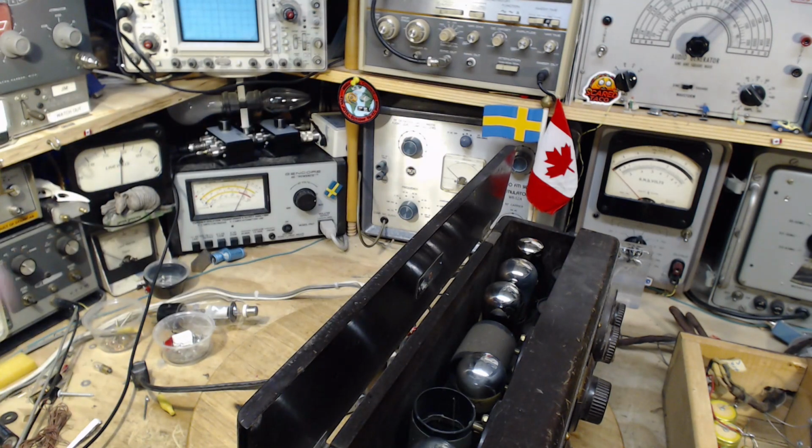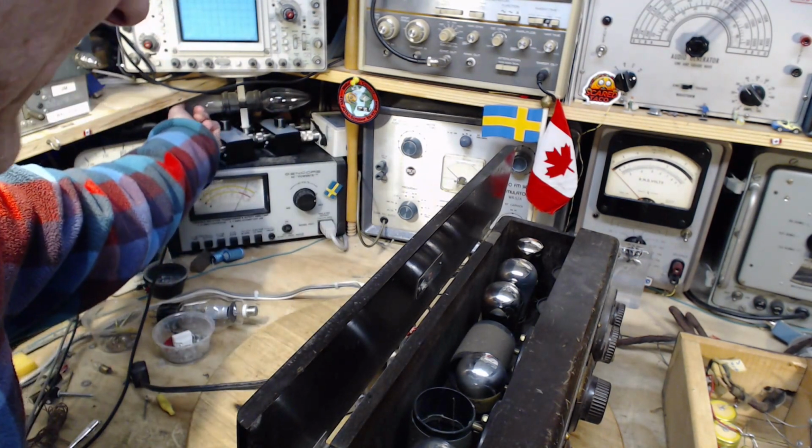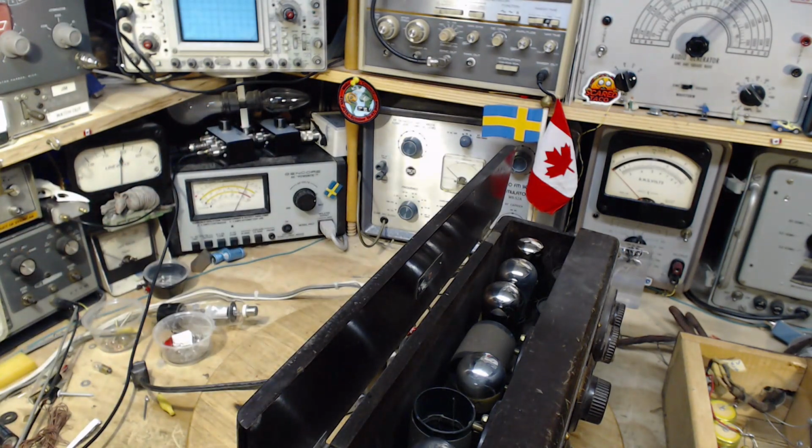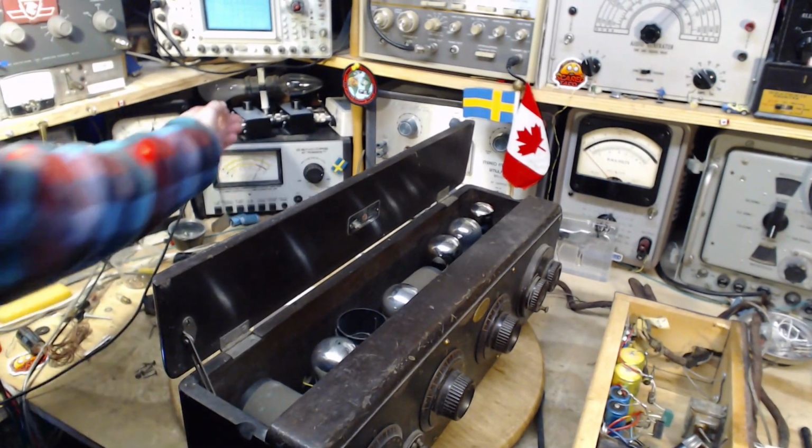when I'm doing this kind of work. You see there's two light bulbs there and two different wattages, and I can loosen one and then force the power all through the other light bulb to really bring on a restriction if I think I should. So right now both bulbs are in. Is that a good idea? Probably not. At the start we should probably start like this.